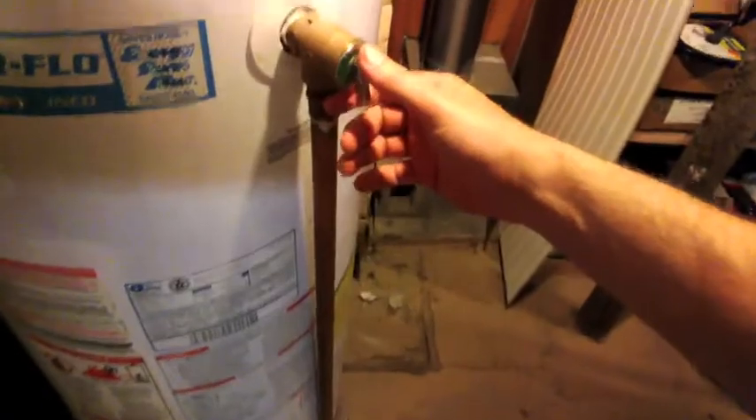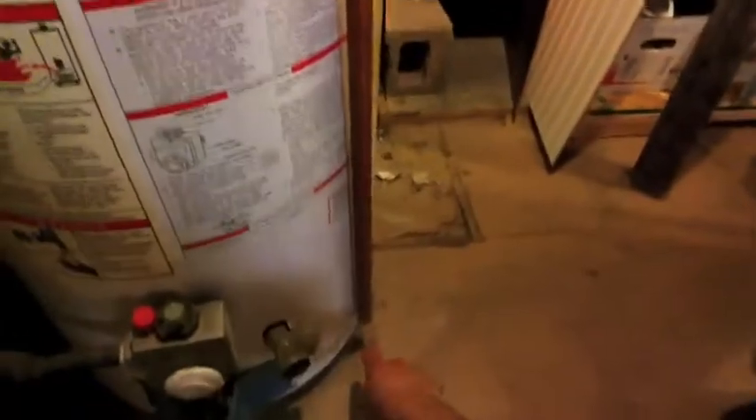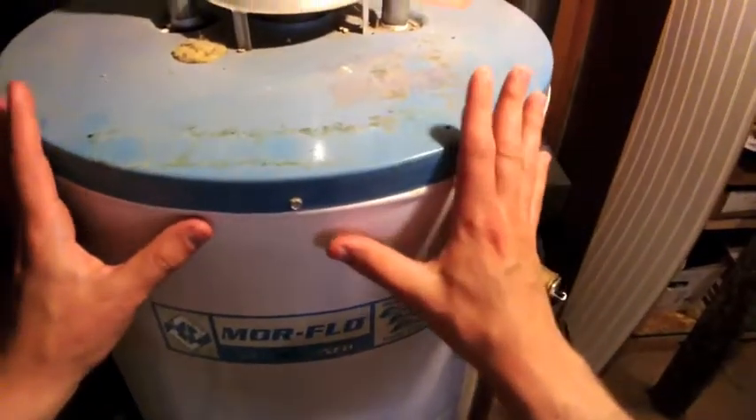In fact, it should be the case that if I pull this little dial — let me not adjust that actually — water would just come out the bottom. I once came home and the basement had a big pool of water down here. It turned out that that valve had kind of broken. It's important that anytime you have a confined, heated system, you have some sort of emergency pressure release valve built in.